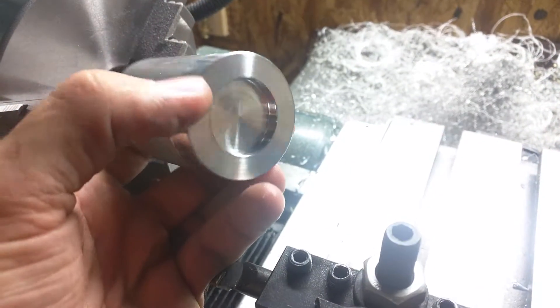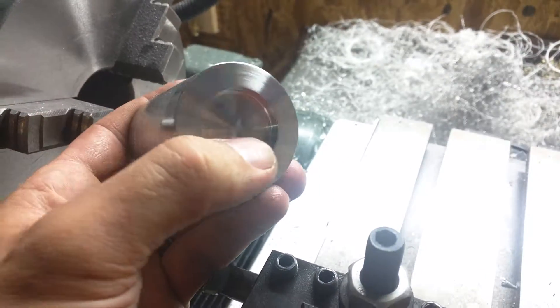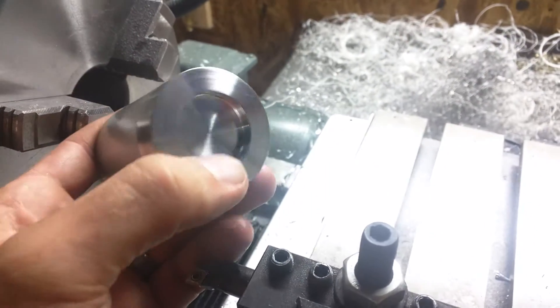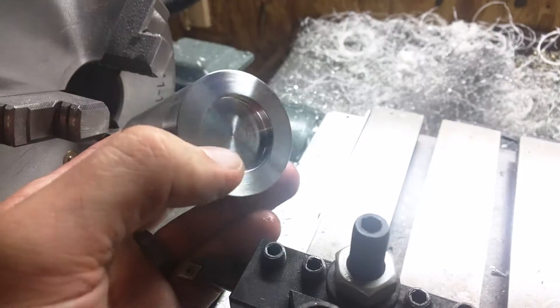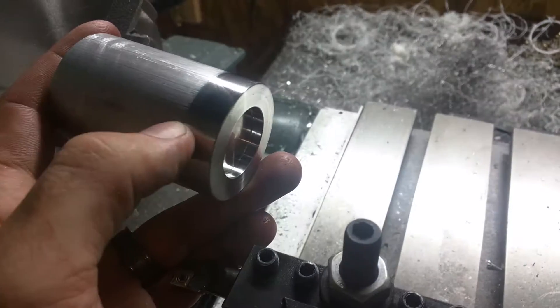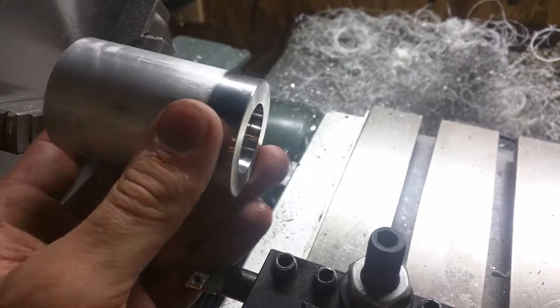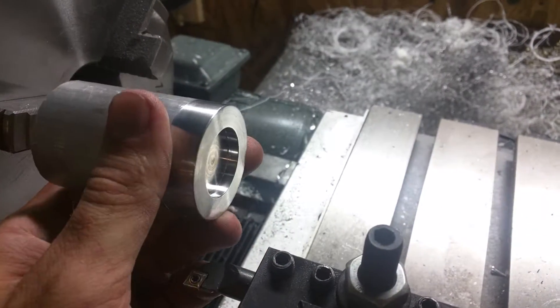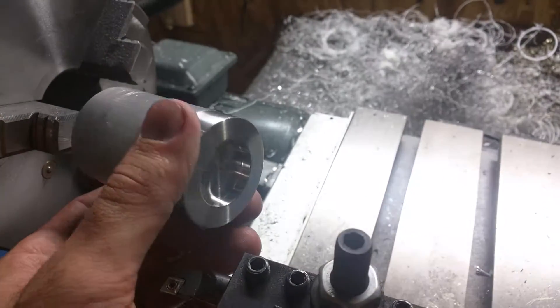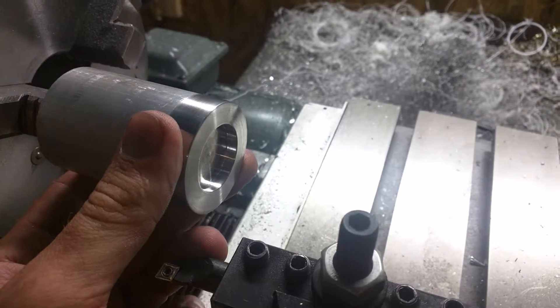So I did that. I was able to do this boring operation with facing, just with the tool here, and I was honestly able to take a lot at a time. It wasn't like I had to hair it off, so that was nice. The only difference is when you come out here to do this OD facing, you reverse your spindle and come from the back side of the work, and that's the only difference.